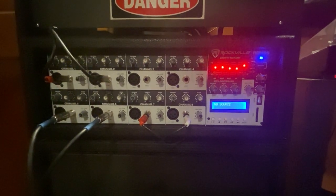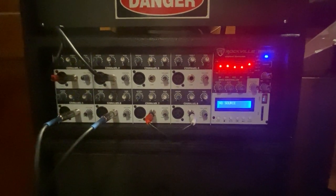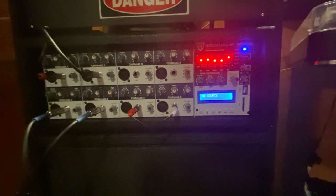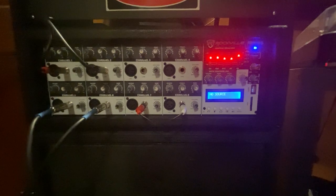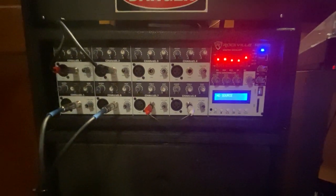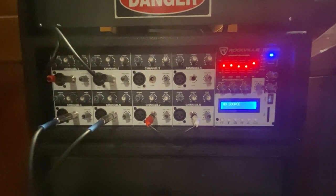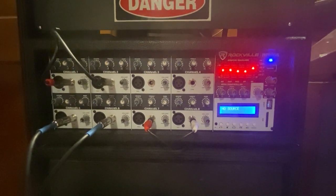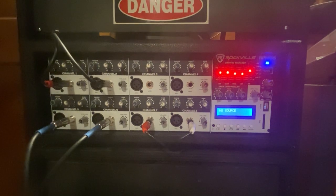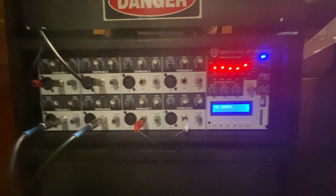Again, it's 300 watts at 4 ohms and 225, I think, at 8. But the thing that concerns me that they don't explain, at least with the older stuff, you know that you plug two 8-ohm speakers in parallel, it comes out to a 4-ohm load on the amp. So if they're saying 4-ohm load for A and B speaker output at 300 watts each, now that becomes a 2-ohm load ultimately on the head. And I've only ever seen 2-ohm loads on very professional power amps and bass guitar amps. So that's something I personally would like some clarification on, if they would ever write me back.